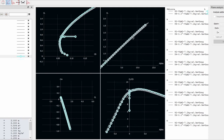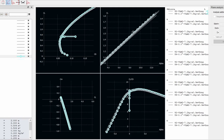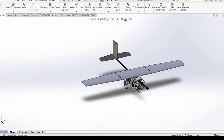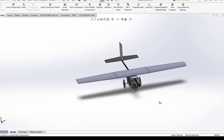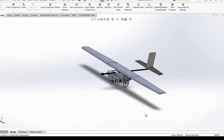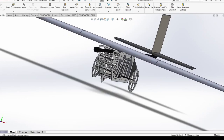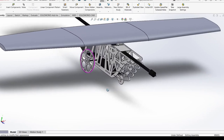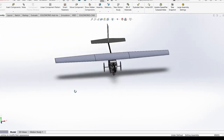Each individual has also been considered for two possible scenarios, with a takeoff distance of 40 meters and a takeoff distance of 60 meters, as these two cases have different treatment in the regulations. Once the results for all cases have been computed, a post-process study has been carried out to compute the score of each individual, considering that all cases participate in the competition. The process has been repeated three times to ensure a configuration close to the optimal.